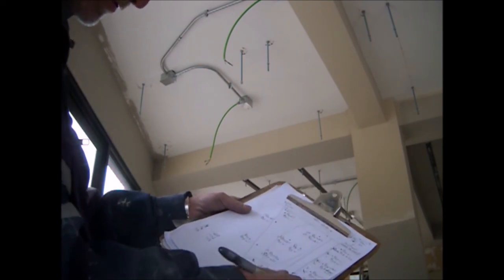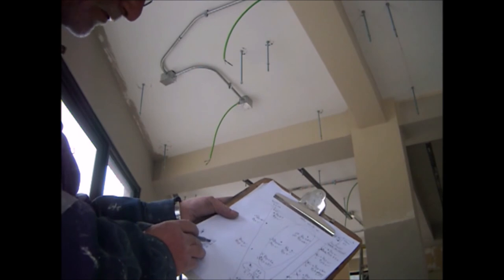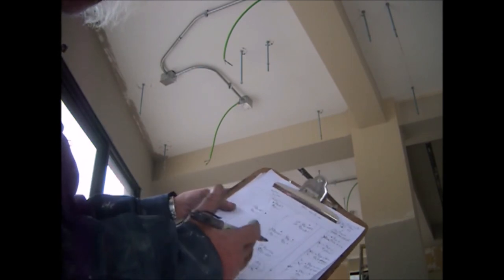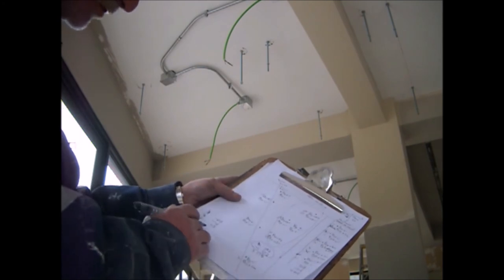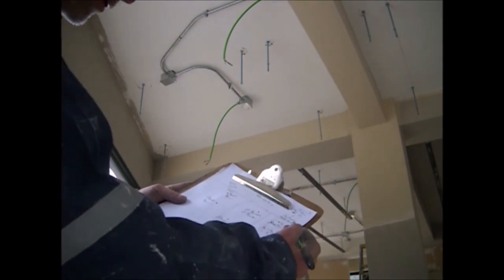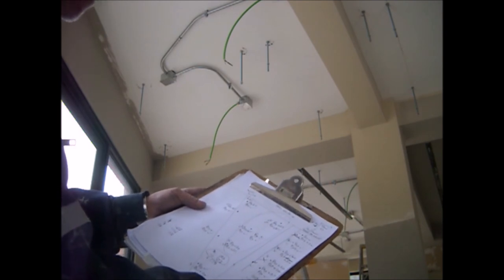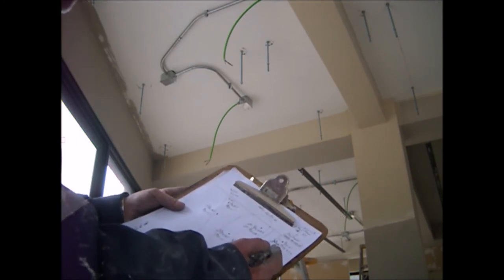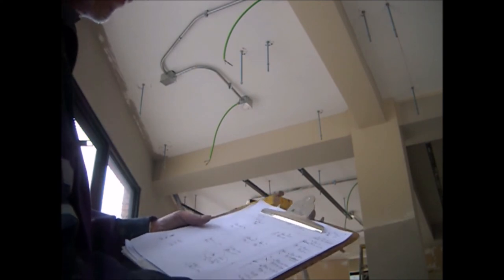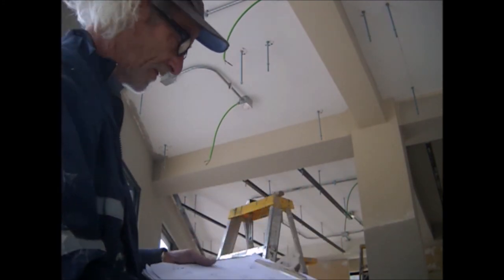Only 12% of the threaded rods will have to be beaten to get them centered so I can fit them into the steel channel. Regarding the hard disk drive, we have 60% excellent and 25% inside tolerance limits, which is 1 centimeter off center. And just like the motor parts, we have 13% of holes clearly off center. Regarding the commercial imitation, we have 50% excellent, 10% inside the tolerance limits, and 40% are beyond the tolerance limits. Now, one of these failed holes was due to a stone which pushed the drill off its bearing, and I can't consider that a failure of the model. But still, the commercial imitation has proved not as good as the other models.